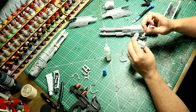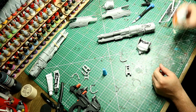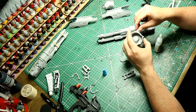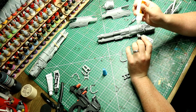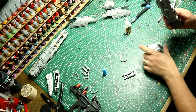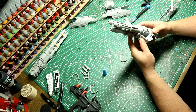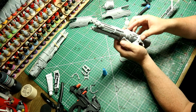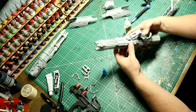Make sure you give it a good coat exactly where the connections are, and if there is a little bit of wiggle room put a little bit more JB Weld in so it fills that gap when you push these together. I've put that JB Weld towards the back so that when these two pipe pieces come together it doesn't seep out and become visible, requiring further filing or cutting away. Get the super glue out - before I've applied it I have keyed those parts with a good little scrape and scratch with the scalpel. Apply super glue in the relevant sections for where those pistons go, then squidge that in, get the pistons all lined up, hold it together just a couple of minutes - basically it will hold itself on its own weight.